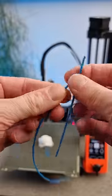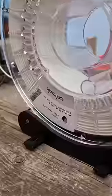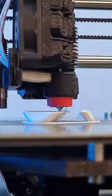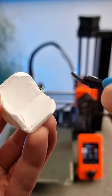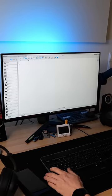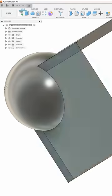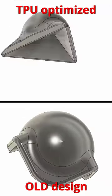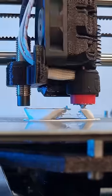So let's tackle this. I tried printing my other design in this flexible material but either the prints failed or the quality wasn't perfect and I would have to do manual rework, which I don't like. So I jumped back into Fusion 360 and changed the design so that I didn't have any steep overhangs anymore and everything could be printed without these jumps that caused the stringing.